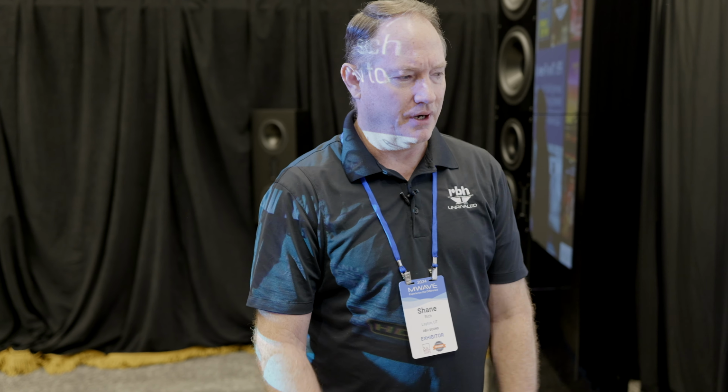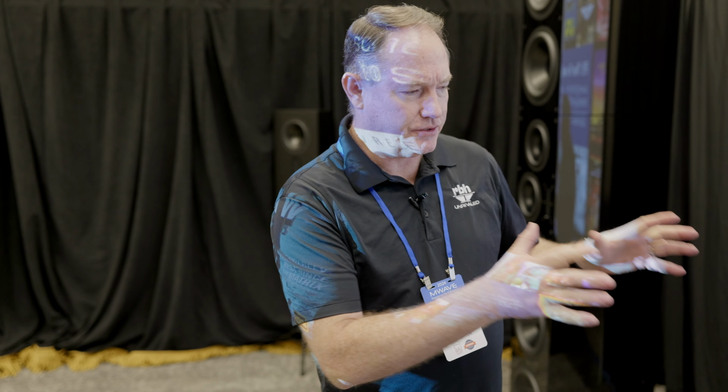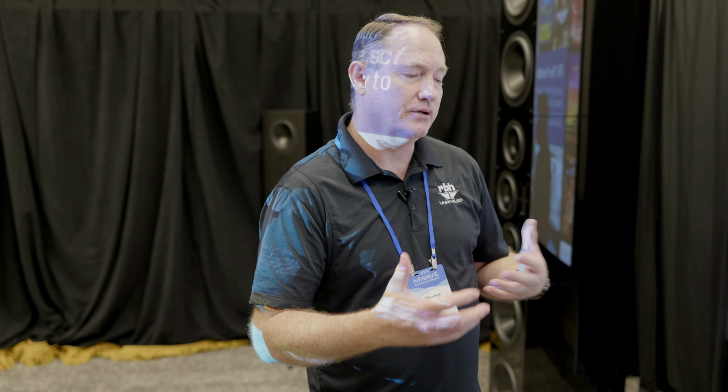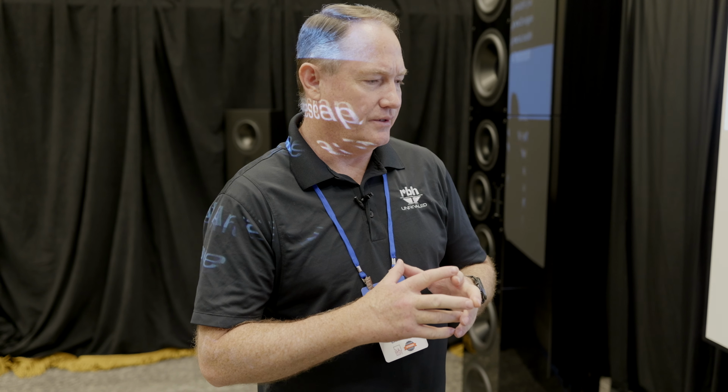In most rooms, we're able to extend that to 10 or even single digit 3 dB down point. That is powered by its own 4,000 watt subwoofer amplifier. And the other thing that's unique about this subwoofer is the granular acoustic damping system that we use in the enclosure, which really helps to dissipate the enormous energies that are trapped inside the enclosure, and it converts that acoustic energy into heat. And what that results in is very tight, accurate bass, so very low Q system, and very linear, nice, tight, accurate, and extremely dynamic.